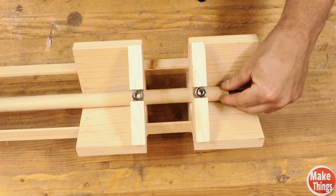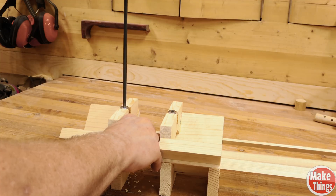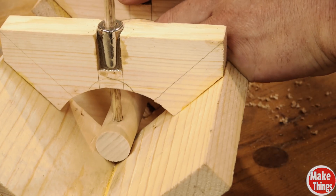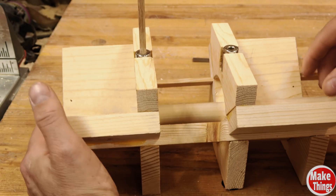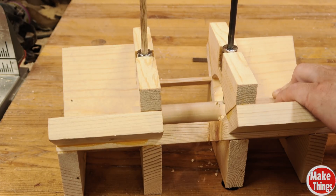With twin beds and twin cutting guides, I can easily add as many horizontal holes as I want that are 100% parallel with each other, by making my first hole and using a peg to lock it in place. Now I can measure and put holes in whatever increments I decide — here I placed them about three and a half inches apart.